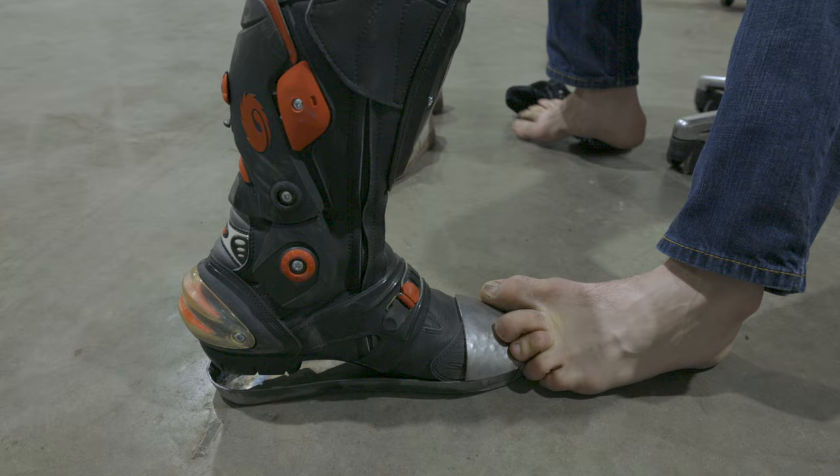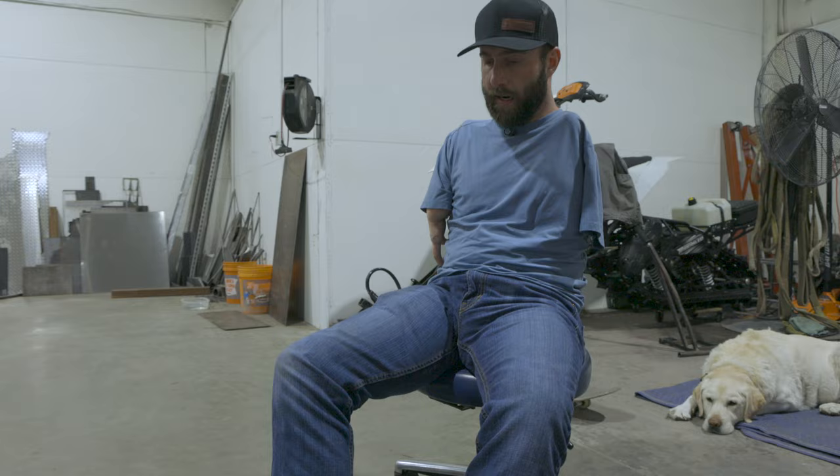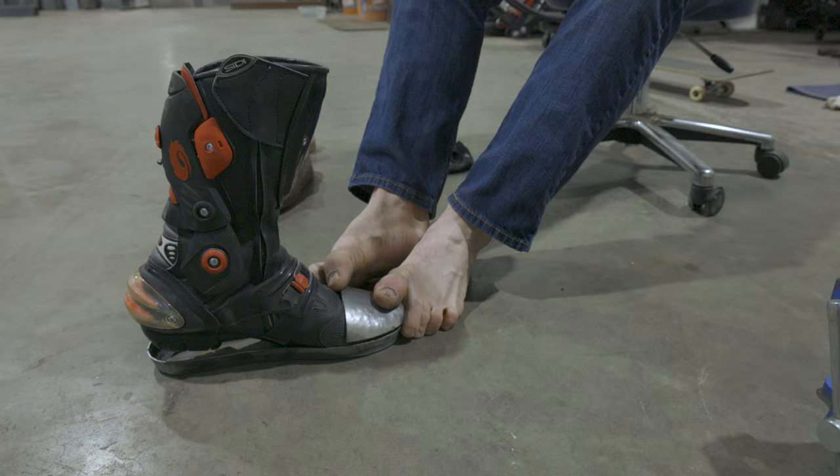I think I'm going to cut it way back — I don't want to capture all that toe. I do think it needs to come up a little bit, but I might just put a gap between the two parts and then weld the gap shut because I'm going to grind it anyway.